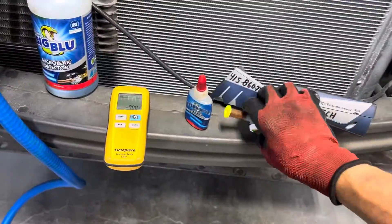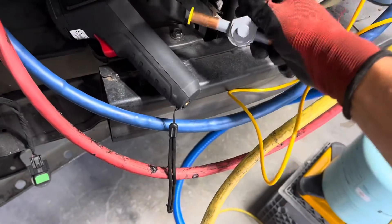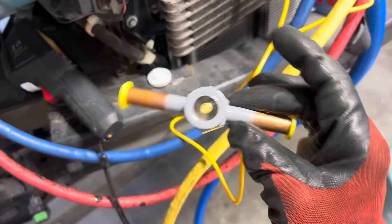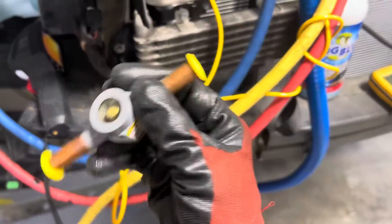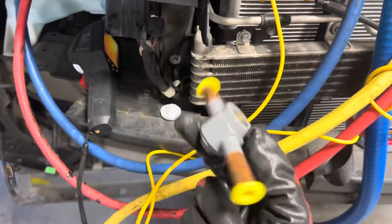Sight glass — for you guys who still make hoses and lines, on your liquid line you install a sight glass with a moisture indicator. This is a moisture indicator, and it's yellow because it's saturated with moisture in the parts per million. You put this in the liquid line of anything going back to the expansion valve. These come threaded too — these are brazed on. If you have universal welding materials that can do copper to aluminum, or you make your own copper lines, you can braze one in, or get the threaded one and put threaded fittings on the lines you make up, and mount them somewhere in the liquid line out of the condenser.